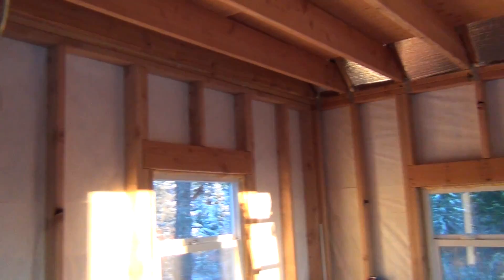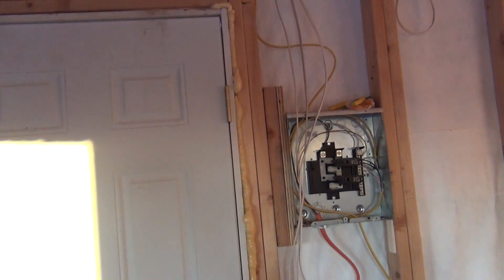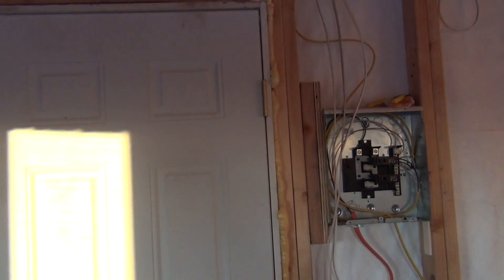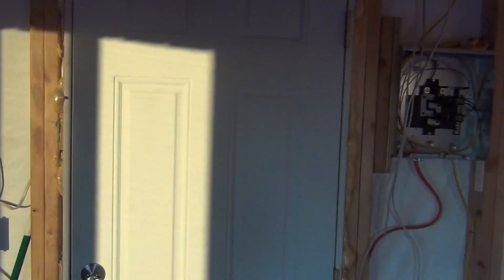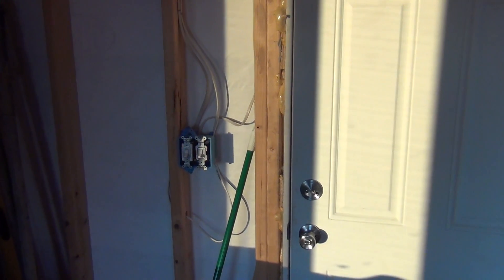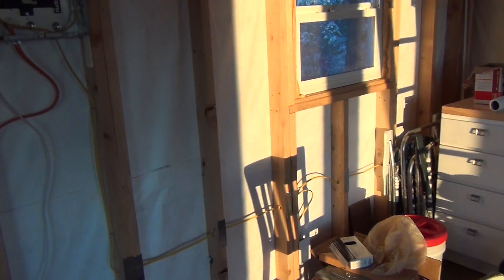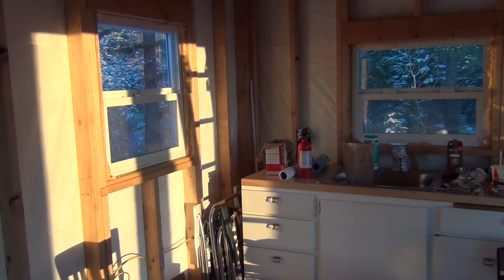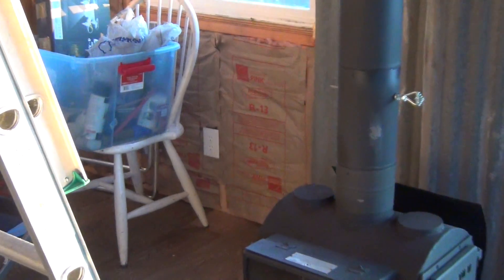I'm going to call it a day — I still have to hook everything up to the box. I gave everything its own circuit to keep it simple: the lighting will be on its own circuit, and the outlets are split — this half on one circuit and the other half on another. That way I can branch off if I need to add stuff and keep everything clean.